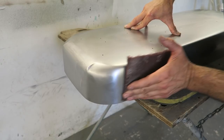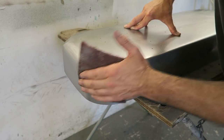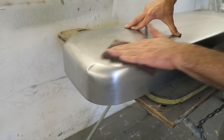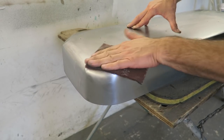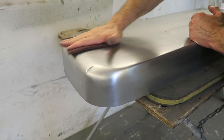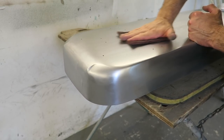the thing is, when you sand things down with the discs, they can put a funny kind of pattern on the surface of the panel, which can make it almost look like it's got dents and stuff going on. If you just finish it off by hand, kind of working in straight lines, you can take that kind of patchiness out, if you're not insane.